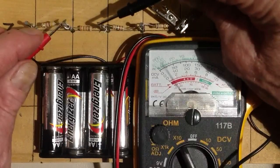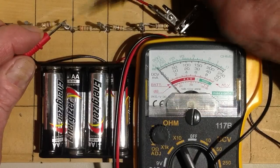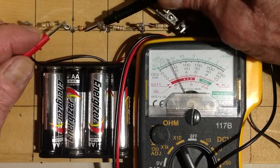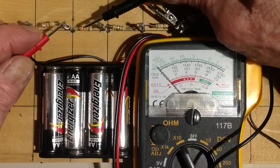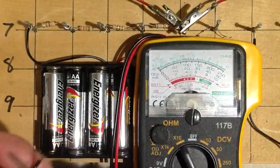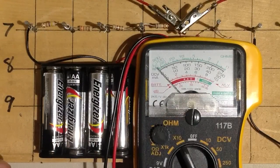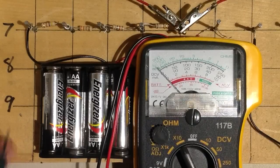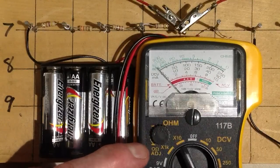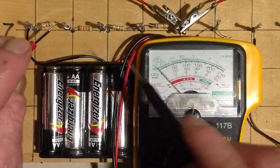Let's look at this next one — it's a little easier to read. See how that kicks up into the green scale? It looks like about 25 or 26. So times 10, that would be 250 or 260 ohms. If it's that low and we try to measure it on the times 1K scale, we're going to get way over to the right-hand end of the scale and not get a useful reading. So we've measured that one.